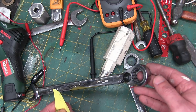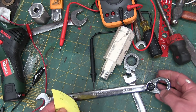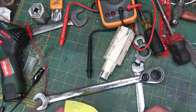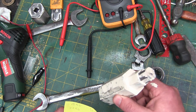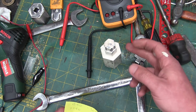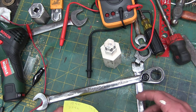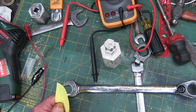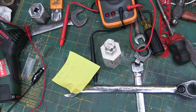The fact that we can do twice that — twice what a typical fastener can handle — with the tool. These things are skookum as frig. Incredibly skookum, more skookum even than the three-eighths square drive ratchets. Just incredibly strong. So I'm going to take a pass on ordering the machine tool steel, because quite frankly these things are so overbuilt that you're never in a million years going to break this before you break a little half-inch fastener. You might wear it out, it might get dirty, you might abuse it with a hammer, but you're never going to break it straight out by using it properly. At 12 inches, you're going to pull on this with 432 pounds — if you can do that, dear lord, you best get somebody else to do it. Thanks for watching, keep your dick in a safe place.